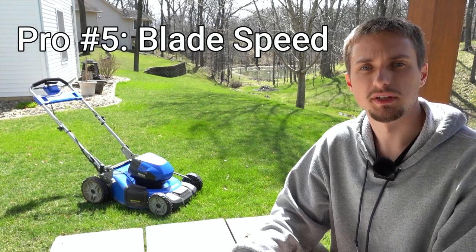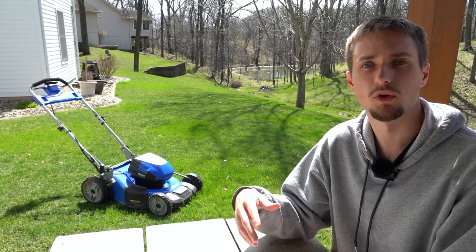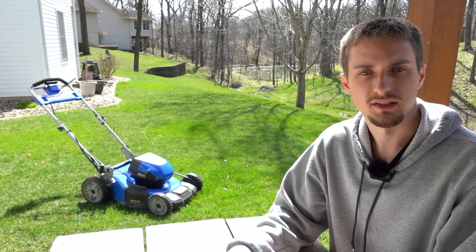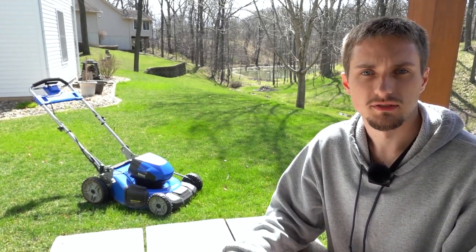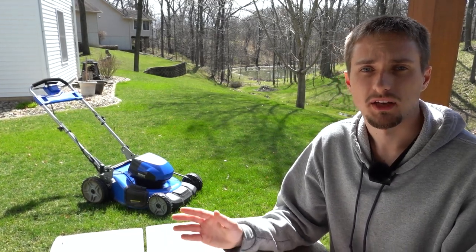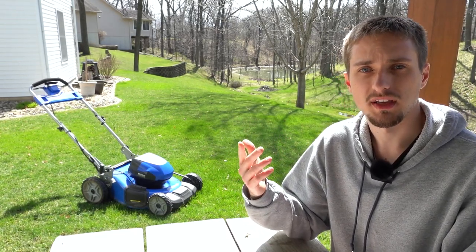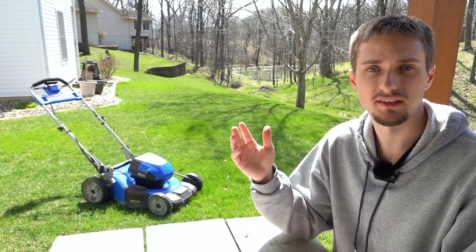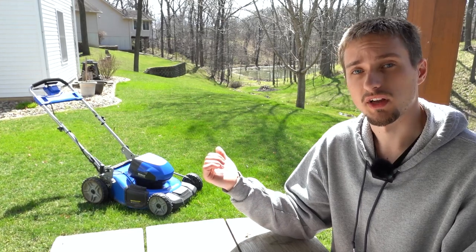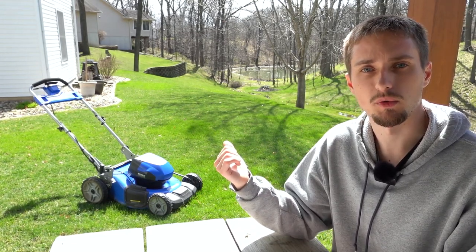The next thing I like is the automatic blade speed control, though it's both a pro and a con. When you hit a dense patch of grass or go through leaves doing heavy mulching, it will automatically kick up to a higher blade speed to mulch and disperse grass better, then kick back down to the lower normal speed once through. However, this mower has a blade that could use a little sharpening right out of the box, and combining a semi-dull blade with the lower automatic speed may not cut as cleanly. I wish there were controls to set which speed you'd like the mower to run on, but unfortunately this is all automatically controlled.